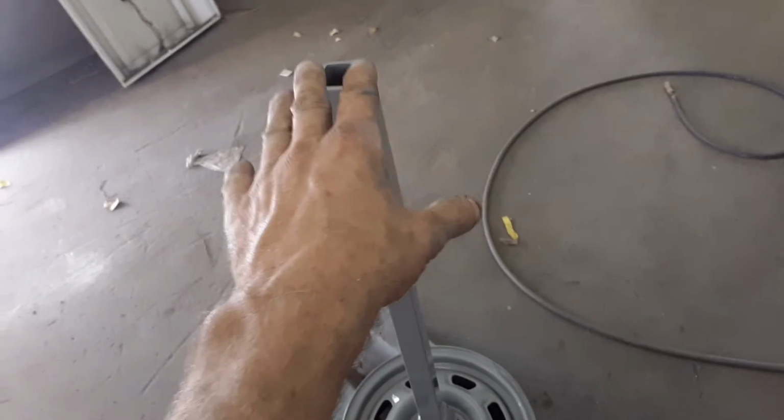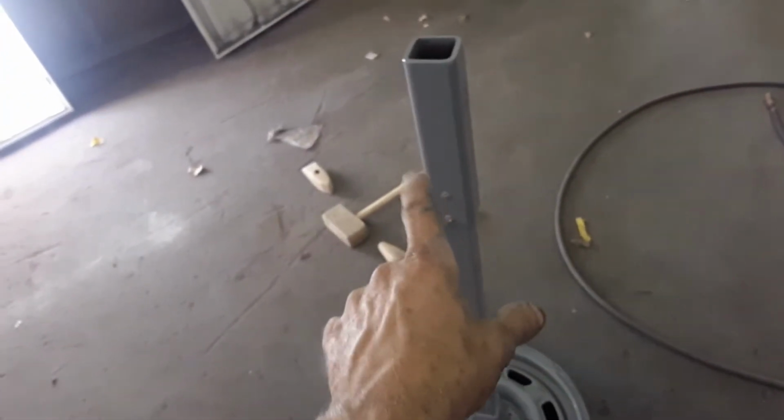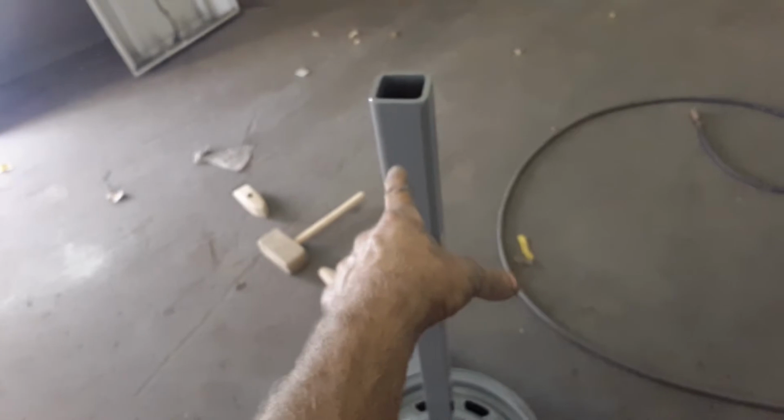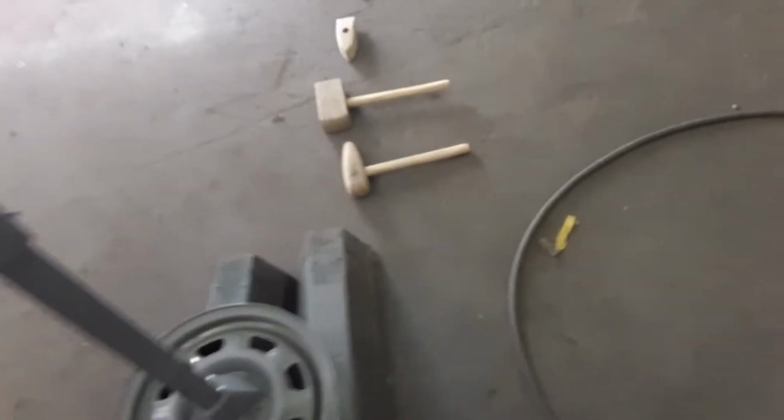Now as I make dollies, I've got some I made for my other tooling posts that'll stay here at home, or in my home shop. But when I start making dollies, I'll make one out of this tubing, and I'll cap both ends and fill it with sand so it behaves like a dead blow. It behaves like an anvil, because with that resonant hollow thud and bounce, you don't move metal nearly as effectively.